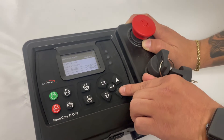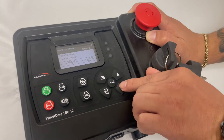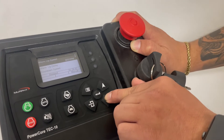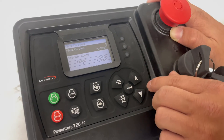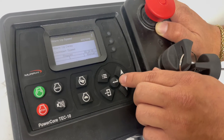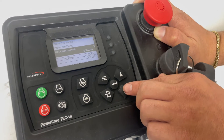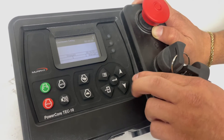We also have a warm-up speed, which will allow the engine to run at a higher RPM for a little bit longer. Once we hit that desired cooling window, the engine will slowly rotate back down to its designated low speed. You can also set your warm-up delay — in this demo, we have three minutes, meaning we're going to run at 900 RPM until we get to our desired temperatures. Same thing with cool-down speed: the engine will run at 900 RPM to cool down before fully shutting down. You also have the delay for cool-down to shutdown.